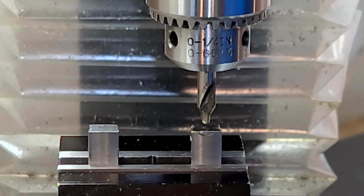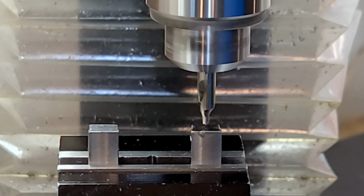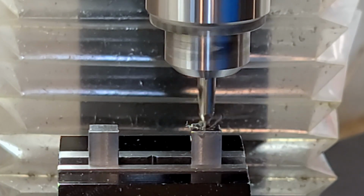Except for the fact I'm not using a small iron drill and tap, I'm pretty much sticking to the book by using a number 47 drill bit. I have found the 47 provided enough hole clearance that I was able to successfully tap with a 3-48 TPI tap, and only when I had converted over and only used good quality sourced American taps.